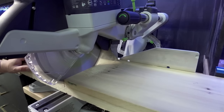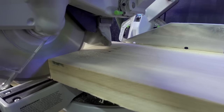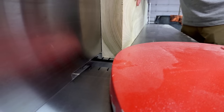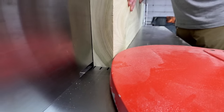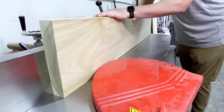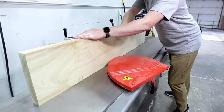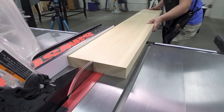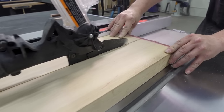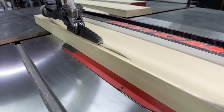When cutting rough-edged lumber on the miter saw, it's best to chop down at the end of the cut, then slide forward and finish off the cut to reduce binding. Then Cody can put one straight edge on them so we can rip them into rough strips. I'm grateful to have a 7-horsepower saw to power through this thick wood — if you don't, just raise the blade halfway and do it in two passes. A dedicated ripping blade is also helpful if your saw lacks power.